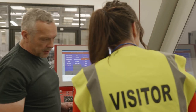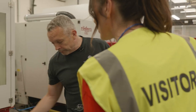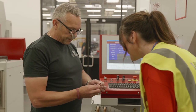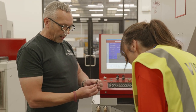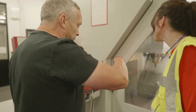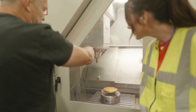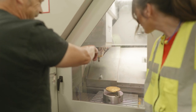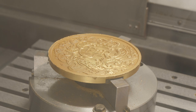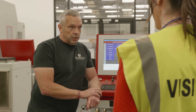So at the moment, if I give you an example, to start the design, the diameter of these particular cutters, for example, is 3 mil. Yeah. And that will start. And that's like a drill base. Yeah, it spirals a couple of thousand revs per minute. And it just spirals around the actual blank and eventually cuts that design. So, the tolerances are quite fine. But literally, this is what this machine does.